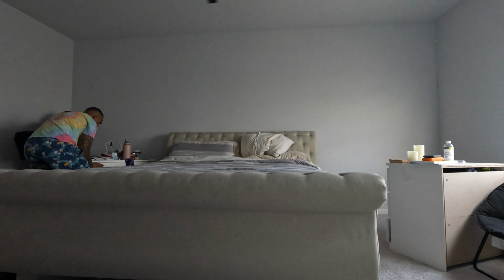So now we get to the point where we're ready to do the vertical boards. And the one thing I do want to mention about doing vertical boards is to make sure that you take into account how long your wall is and how far you want the boards to be spaced, so it looks even and consistent as you go across your wall.